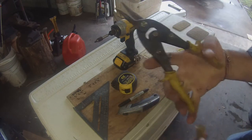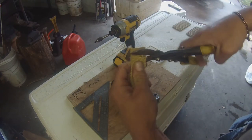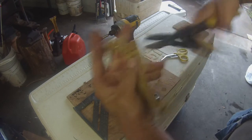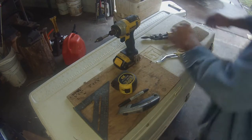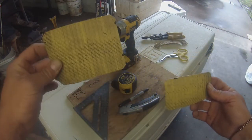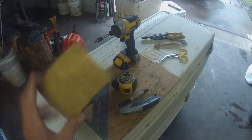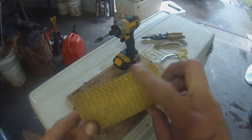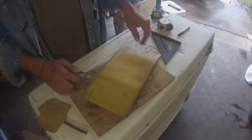Regular straight yellow metal shears — they're good shears — they'll get through it but they make a mess of it and tear it all up, so I don't recommend using that either. So like I said, here's what we're starting with. On the bigger coolers I'm using a 5-inch wide by 4-inch tall piece of hose, and on the smaller lid one I'm using a 5-inch wide by 2 and a half inches. Let me go ahead and get set up and show you how easy this cuts.